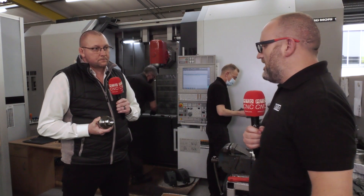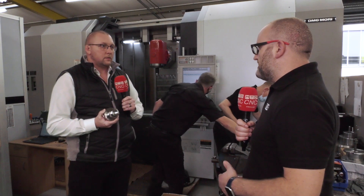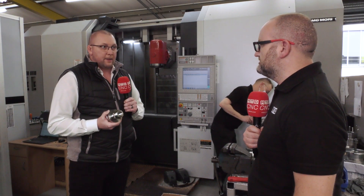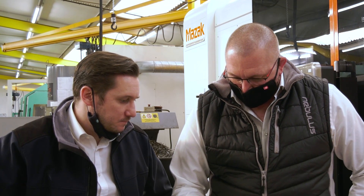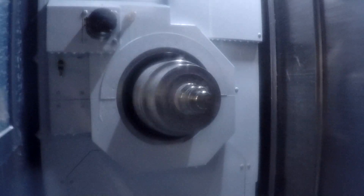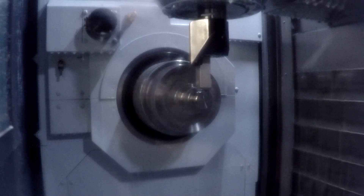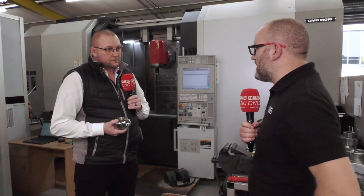You've mentioned YBS a couple of times — I know that's one of your carbide grades, but it's got a little something extra. Yeah, so the YBS grade has an additive in the cement itself that makes it stronger. We did all the external turning features with the YBS, and we also used the indexable drill, so all the boring is done with this technology as well. As you've seen today on the feature, we didn't get any notch wear or plastic deformation — the insert is very, very strong for these types of materials.